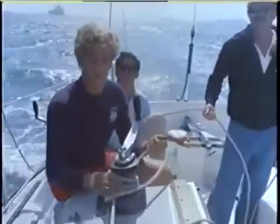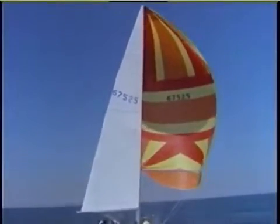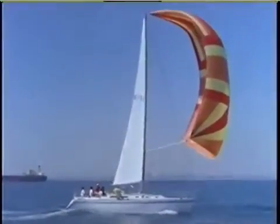When the pole is too high, there is insufficient tension on the upper luff and it becomes unstable the other way, actually folding around the chute in extreme cases. Vertical wrinkles in the head of the sail give us another indication that the tack is too high. Lowering the pole to the proper height stabilizes the upper luff, smooths out the head, and lets the chute develop all the power the sail designer intended. Result, you go faster.